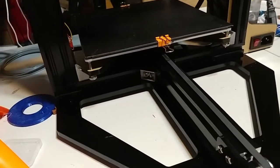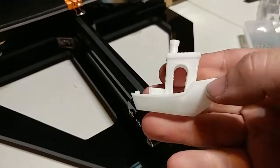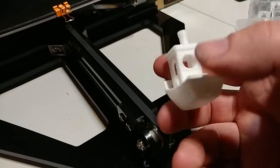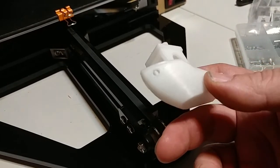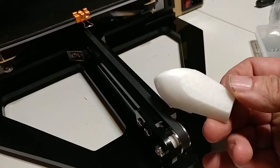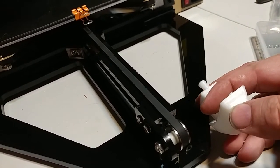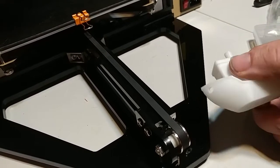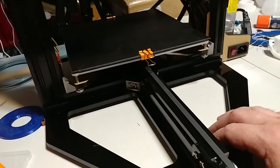Tomorrow I will replace the stepper when I get home and we'll see if we can breathe life back into this machine — it's actually doing a pretty good job. Here's the Benchy it printed. That's really not bad, and I did no tuning at all — I just stuffed the Benchy on there with settings that made sense and clicked go. Almost no stringing, very clean. There's a little bit of wobbling right there — not sure what that is. Overall relatively low noise, nice print, the bottom looks good, and the text is nice and crisp. That's a pretty good Benchy, especially for something unreinforced and untuned on a $220 printer. Five bucks in components and you can reinforce it nicely.